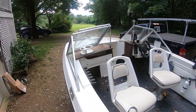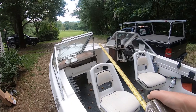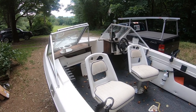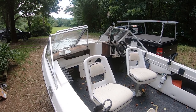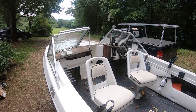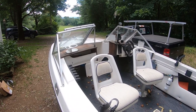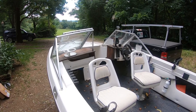Here's the boat we're going to be putting our top on — a 17-foot Glasstron. I want it to extend up to where the hinges are and come back about six feet. I originally thought about putting a metal top on the frame, but because of the added weight and higher center of gravity, I didn't want to make the boat unstable in the ocean. So I decided to use a soft top — a Harbor Freight heavy-duty tarp. They're inexpensive, and I can keep a couple in the truck. If it rips, I can replace it in a few minutes. If I take the top off while trailering, I don't have to worry about it ripping or the wind catching it.